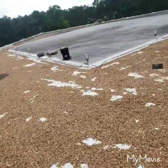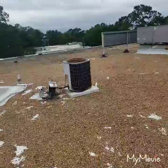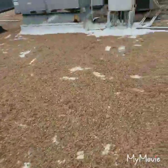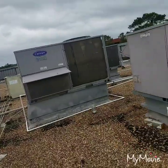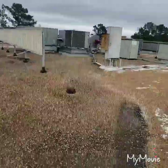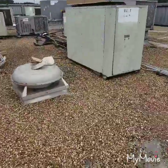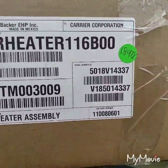We got this big unit out. I think we're going to replace this unit, and I need it hooked up — I haven't even looked at it; I don't even know where the air handler or the furnace or whatever is at. I haven't done anything to this side yet. I'm going to check these units out too — do a magnet check, get the filter and belt sizes, wash all the coils, and start a repair list. Come back and start this heater Monday. We out.